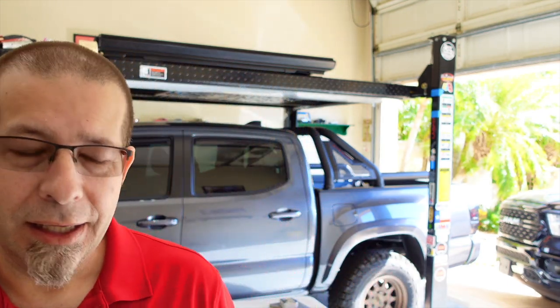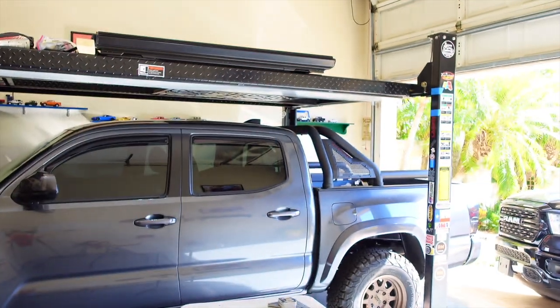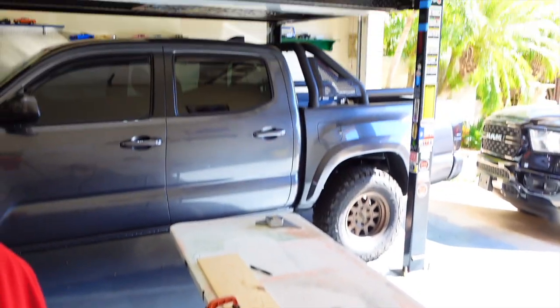The distance between the two edges inside the truck is 52 inches. I'm going to put my edges on the inside of the board, so I have to subtract the width of the boards on each side. What I bought is one by eight, eight foot — it's three quarter inch thick. My sides are going to come from what's left over and are also three quarter inch, so that's an inch and a half to subtract, leaving me 50 and a half inches. I'll cut that with a jigsaw since I don't have a circular saw.